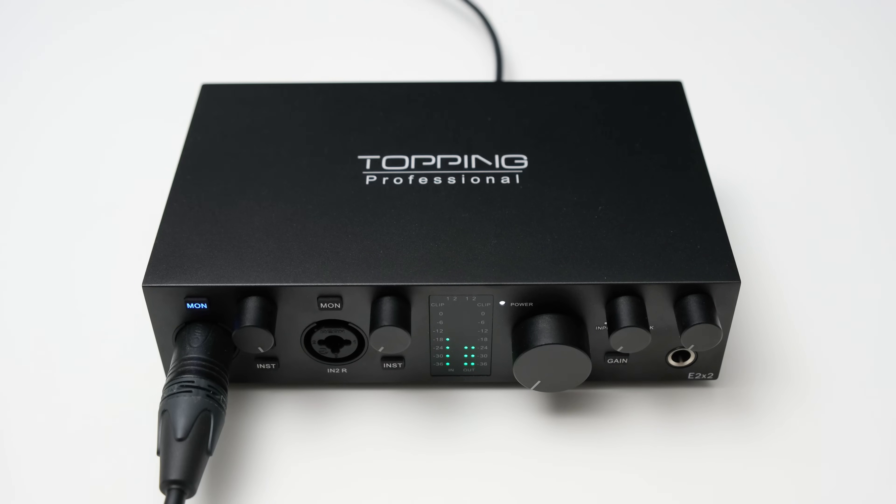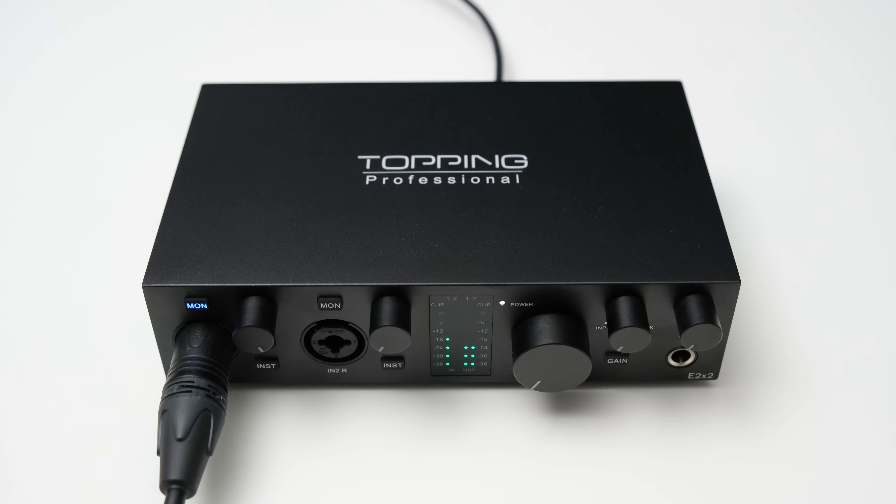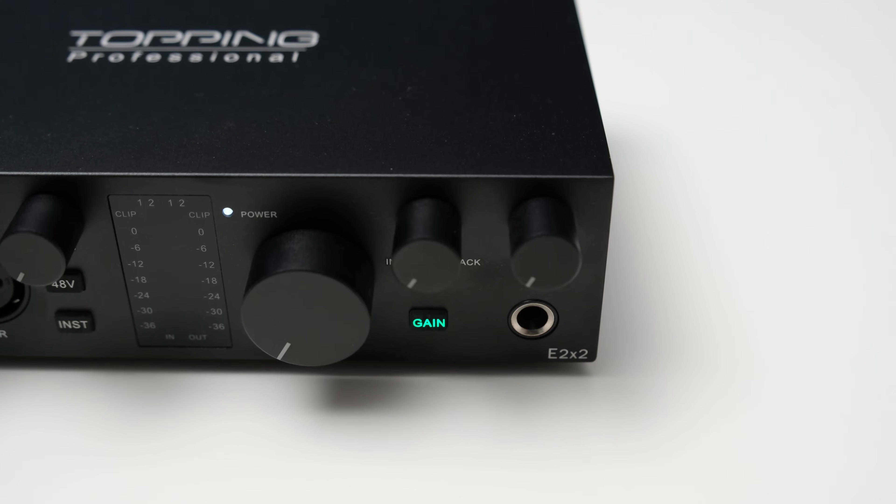You get three more knobs: a main volume dial, a mix dial for direct monitoring, and a headphone volume dial. There's also a quarter-inch headphone jack whose performance is unlike anything else I've seen from an audio interface so far. Another thing I haven't seen on any other audio interface I tested is a gain button. This lets you toggle the gain of the headphone output so that noise and volume range is optimized. If you don't have such a button and use sensitive IEMs, you might only be able to turn up the volume dial to a third before your IEMs get uncomfortably loud, unlike with normal headphones where you might be able to use the whole volume range. Also, the noise should be lower when listening with IEMs, as they make the noise of headphone amps much more apparent.